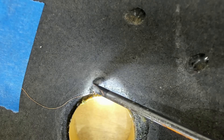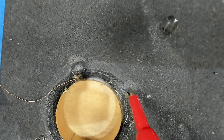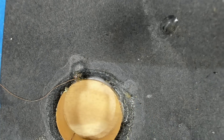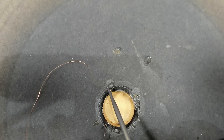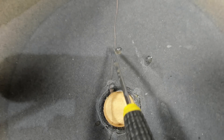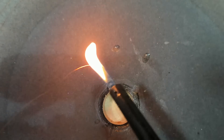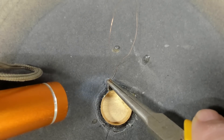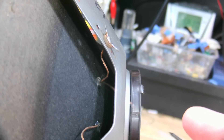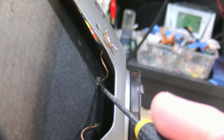I think that's got it — I can see the solder on the old bit and the new bit of wire. I've attached the new wire to one end of my multimeter, and here's the wire coming out of the coil — I can see that it's bare. So, 12 ohms — really good. I'll punch a little hole next to where the original hole was and feed that wire through there. Before I poke it through, I'll clear off this area of enamel so I can attach it back here — I'll do that with a little flame torch. There's the hole, I'll see if I can get it in. So here's my new wire and I need to connect it to the flexible wire. They usually solder it on the inside of the cone and then put some glue around to hold it all.